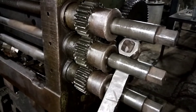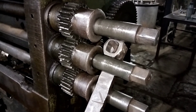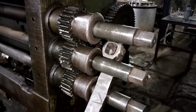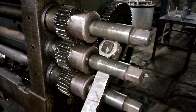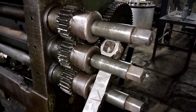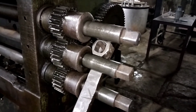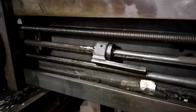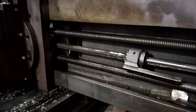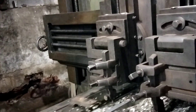As each stroke is completed, the belt changes a little and through it the motion is transmitted to the gear, which moves a small amount. According to that movement, the tool head moves and you provide feed — one cut, then the next cut. You can set the amount of feed on the lead screw, and as each stroke completes, the tool head moves by that feed amount automatically.